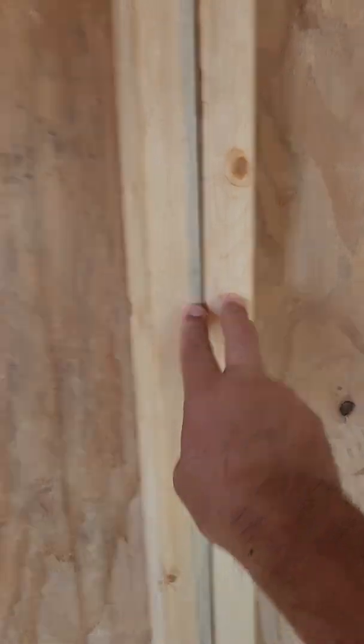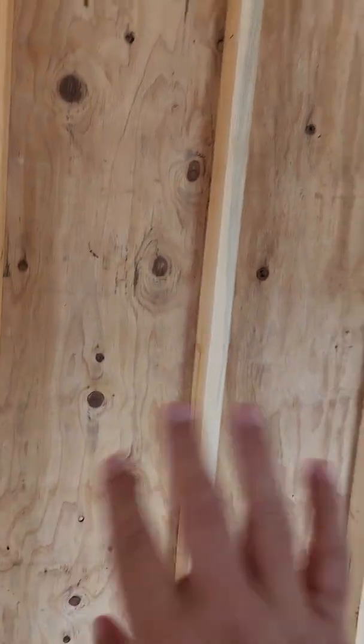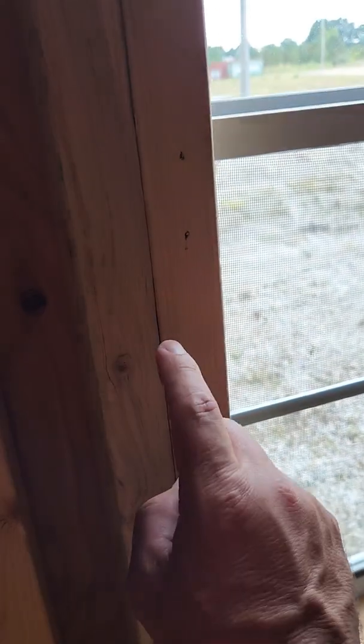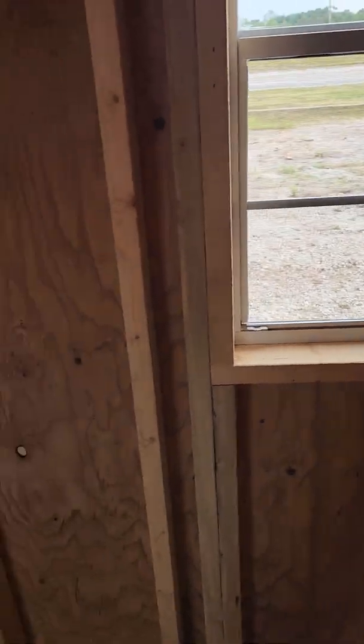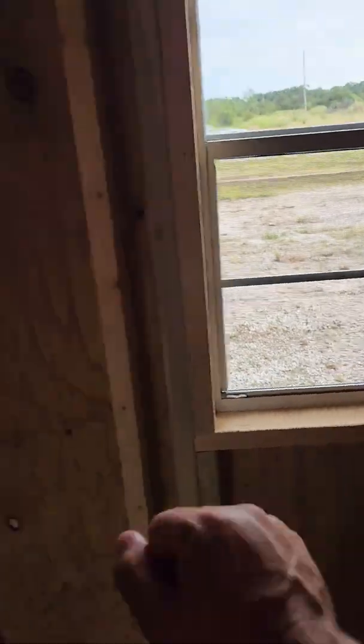In the walls, 16 inches apart, are our standard 2x4 wall studs — 16 inches, like you would build in a home. Then we double them up every four feet. We use more wall studs than just about any other portable building manufacturer, and that means a stronger, sturdier wall. Most competitors space them 24 inches apart. The windows are also double-framed with double 2x4s.